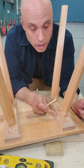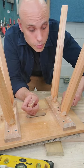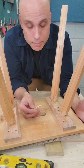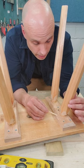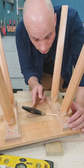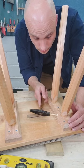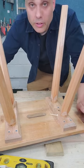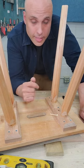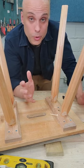What I figured out was drilling a pretty small hole with a twist bit through this batten, so that it travels through the end of the tenon and into the other end of the batten — but not through, because that would look messy. I've got a piece of bamboo chopstick here with a little bit of glue on it, and I'm going to stick it in that hole. The sound just changed, so I know it's not going to move in anymore. Now that chopstick is pinning that tenon all the way through the batten and adding a mechanical interlock, which I think is better.